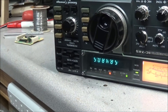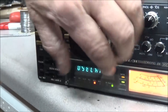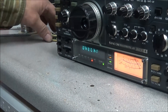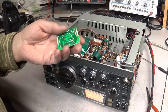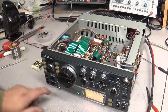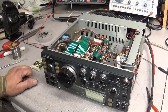I'm able to go through the modes now, but as you can see there's no band information in the radio. So I'm going to say that myth is debunked and busted. My RAM board is back installed and everything is back working. As soon as I pulled the RAM board out, the display went to all zeros — that's the first sign right there that tells me it's not going to work. The radio has got to have the RAM board in, or it's going to lose communication with the main microprocessor.